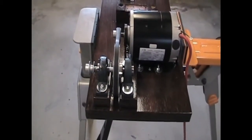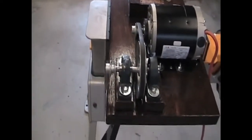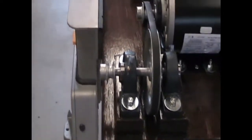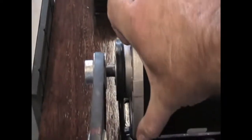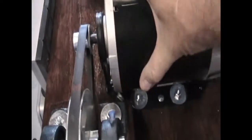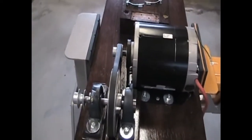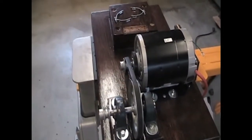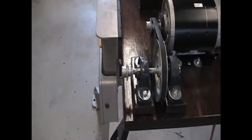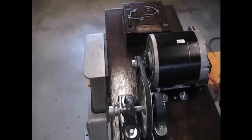Here's the motor in place, connected to a five inch pulley. Over there is going to be an inch-and-a-half pulley that connects to the twelve inch pulley of the meat grinder. One thing I really like about the resilient base is you can just take off the two clamps and lift the motor up to change the belt, although I don't think that'll be needed very often. The final RPM of the meat grinder will be 64 RPMs — 1725 motor with an inch-and-a-half pulley up to a five inch pulley, then on the same shaft an inch-and-a-half pulley to the twelve inch pulley on the grinder.